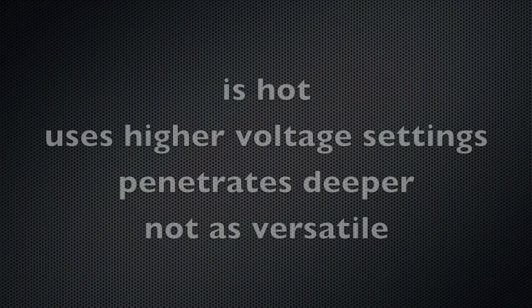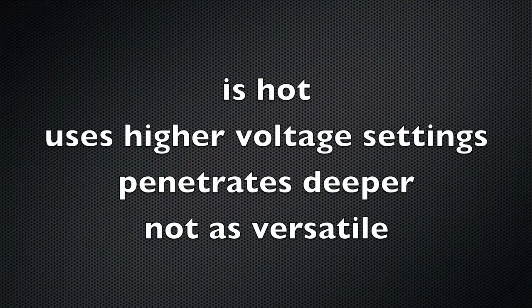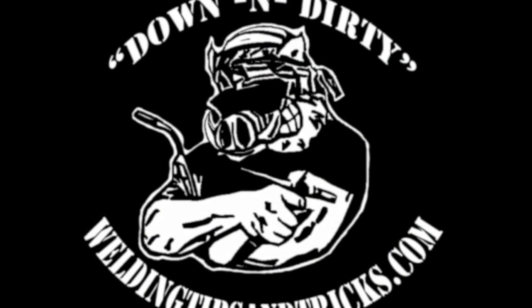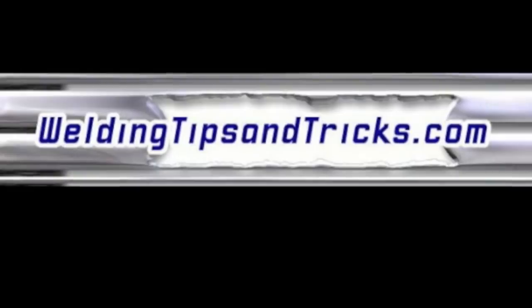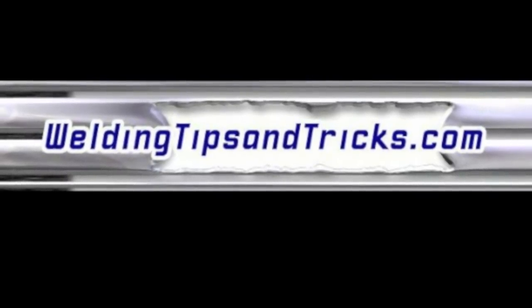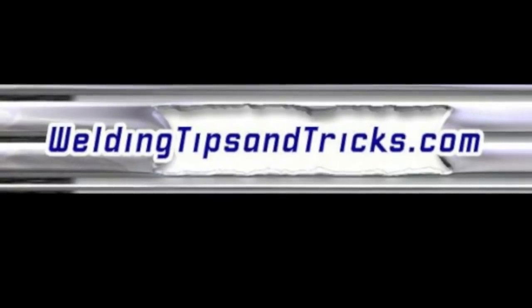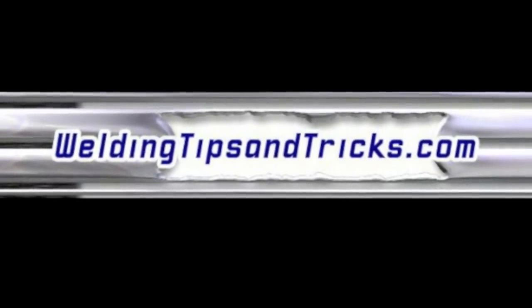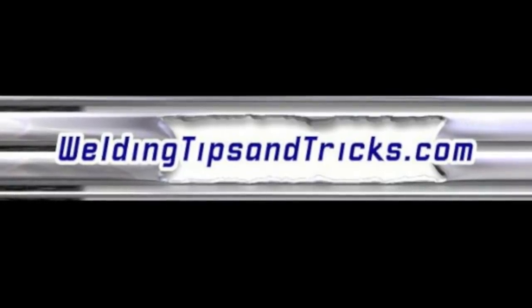Now, spray transfer MIG has a whole different sound. It's got a hiss or a hum. Very hot, uses higher voltage settings, penetrates deeper, but not as versatile. Can't use it on really thin sheet metal, can't go vertical up on anything much. It's a production method. If you're welding railroad cars, spray transfer MIG, way to go. But there are other times when it comes in handy also.